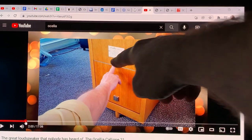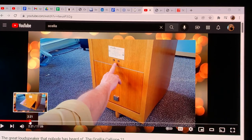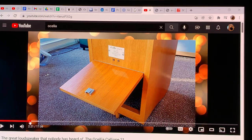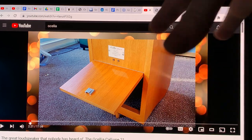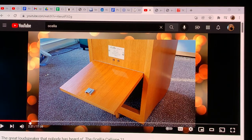He's now showing the back of the speaker — the speaker terminals and a small door. Depending on how much you open that door, you change the tuning of the cabinet. The bottom of these cabinets is perfectly open, so it's essentially a box open on the bottom. Some people would call this halfway between an open baffle and a bass reflex cabinet, but technically it is a mass-loaded transmission line.